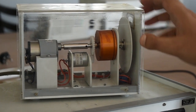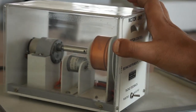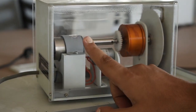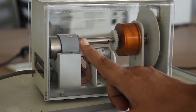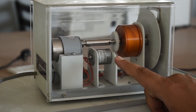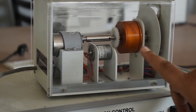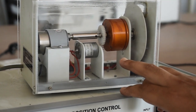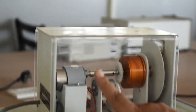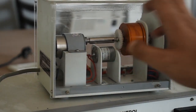A calibrated disc mounted on the potentiometer indicates its angular position. In addition to this, we have the tachogenerator that is attached here with the motor. The tachogenerator is attached with the motor shaft, which produces a voltage proportional to its speed, which is used for velocity feedback.